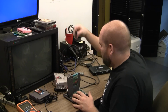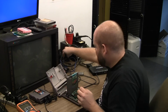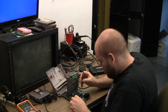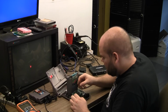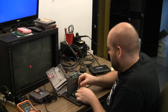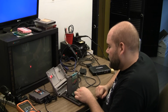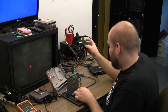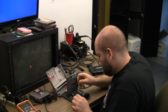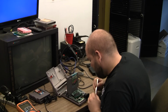I guess I could try my old SCART cord that I know has another 220 on the composite pin. Still in bypass. Feed composite sync. So maybe that big cap on the composite line in the SCART head does make a difference. Which there's no, I don't believe there's a big cap on the composite sync output.